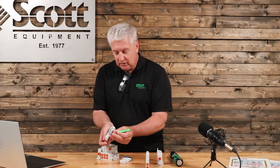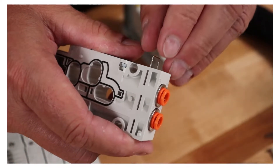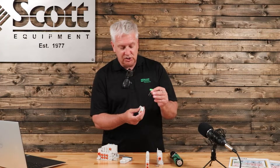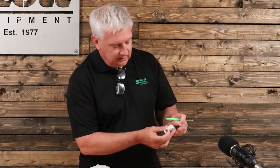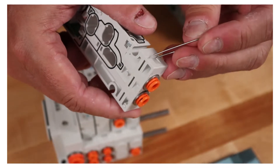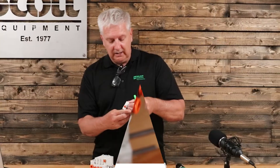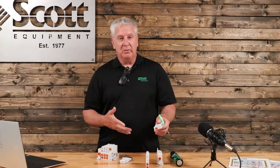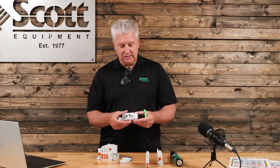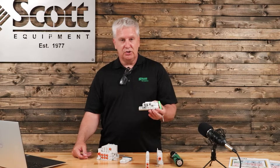The next thing I'm going to do is figure out why this thing is making so much noise. I turn around and go straight for what we call the diaper pin or the lock pin for the fittings. I pull the fitting out and I notice that the fitting is loose. What ended up happening was the gentleman changed the component on the fitting, and when he went to insert the fitting, he didn't seat it all the way to the back. A little push with an O-ring, a quick drop of the clip, and we're off to the races. We reassembled the manifold — no problems. Even though there are a few more parts and pieces, if you know what you're working with, we fixed this valve bank in probably three to five minutes: put it back together, checked the electrical portion, good to go.